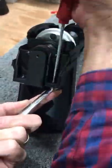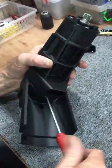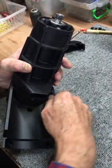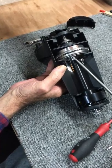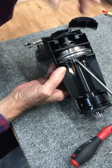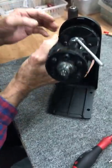Okay, I tighten it. And I tighten it. I'm using the box end on this. Then I reach under here and I finish this one. Okay, at this point you look to see if you've made any little marks, and most of them will just rub out with your finger. Now I'm ready to go ahead and put it into the case, because to finish off the spring I have to have it in the case. Alright, so I'll just do that. Make sure you do not forget this part. Ask me how I know. Okay, I drop it in the case.